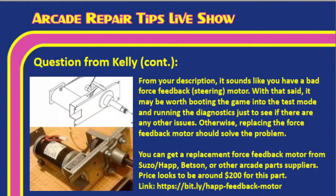Yeah, and let me go ahead and put up the slide here, Tim, so we can get the information. From your description, Kelly, it sounds like you have a bad force feedback steering motor. With that said, it may be worth booting the game into test mode and running the diagnostics just to see if there are any other issues. And Tim, I texted you this question, and you told me that ahead of time. Otherwise, replacing the force feedback motor should solve the problem.